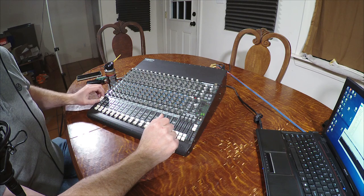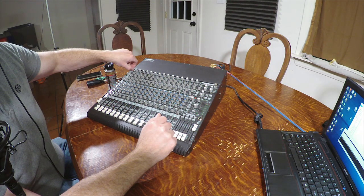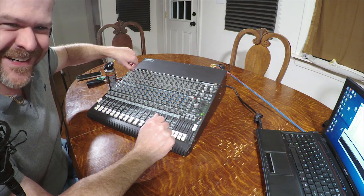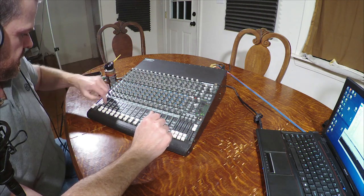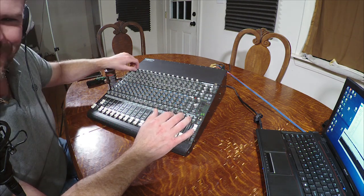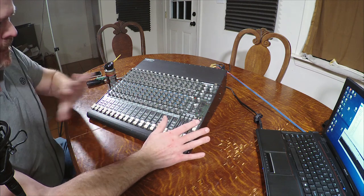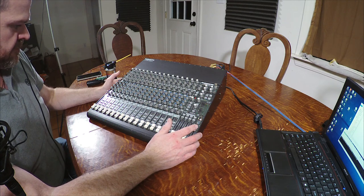Kind of hear that breakup, and you really hear it with the gain knob. It's that popcorn sound you don't like. See, same thing in all the channels that do it. Some channels either. You guys know the little finger tap to get the channel to work again? Yeah, we don't want to do that anymore. But I'm going to go through, we're going to take this thing apart, and I'm going to try to go through every single channel and hose it out and see if we can get some more life out of this.